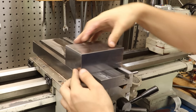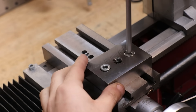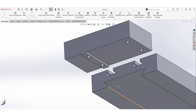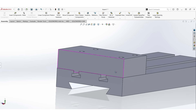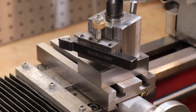With the block now cleaned up, I'm going to make a design change compared to the old riser block. The old design was simply a steel block resting on the cross slide held in place by only two cap head screws. The new design is going to have a slot that registers in the T-slots, which should aid the bolts in preventing the tool post from shifting under load. It also keys it to the T-slot, keeping the compound square to the cross slide. Credit to NBRworks who also did this, though I'll only be doing it on one slot whereas he did it on both — I think constraining it using only one slot is probably the easier approach.